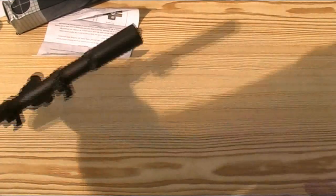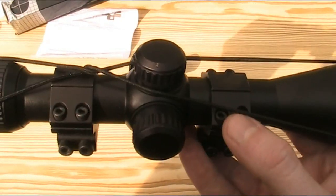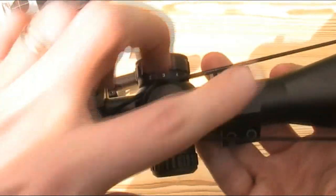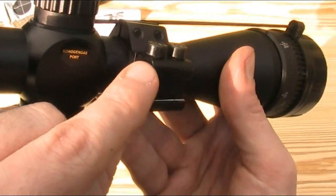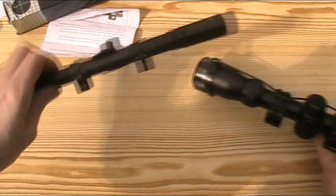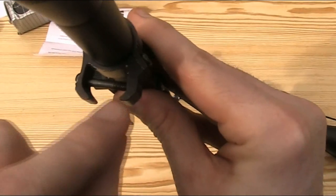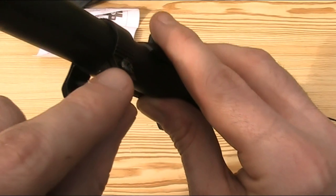And what I mean by that is that on most conventional mounts such as these on this other scope, this top piece of the mount actually comes off and is fixed on both sides to apply even pressure to the scope tube, and it has a separate piece for clamping the scope onto the scope rail. So on these cheap mounts you just rely on the screw tightening and therefore I suppose bending the metal to clamp it onto the gun and to clamp the scope tube in place,